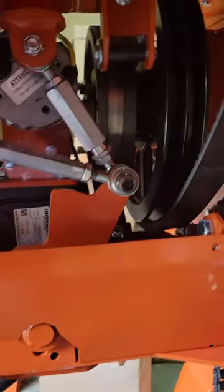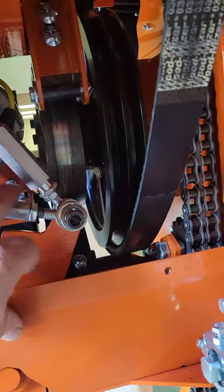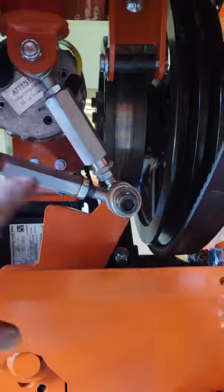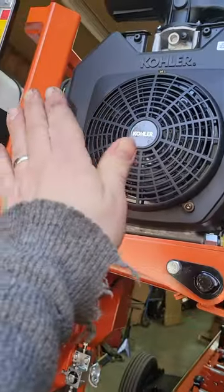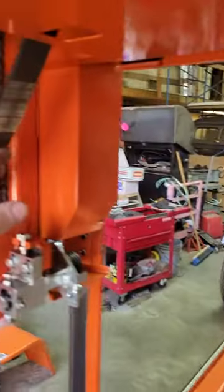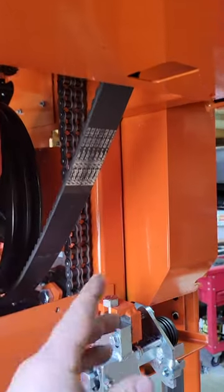So that took both hands, but now you can see that this is collapsed down to about a quarter of an inch to three-eighths of an inch. That's allowing this motor to rotate over a little bit and allow this belt to be more relaxed underneath, so it doesn't drag on the front pulley sheave up top, causing the smoke and the squealing.